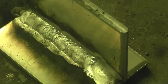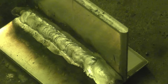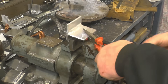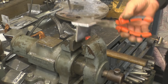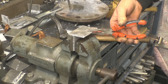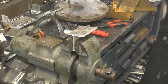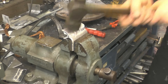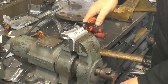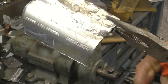That really welded nice — no doubt about it. I'll do a little destructive test on it now. That's the weld we've just done — only one side has been welded. We'll do a test while it's still warm. There are several methods of testing welds but this one gives a pretty interesting result. I think you've got to agree — there's not a great lot wrong with that really, is there?